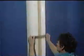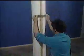Fill all holes that were recessed for rivets and screws. When filling various configurations of the base or capital, a paint stick or simply your finger will do the job. Allow to dry 5 minutes or so. Using a flexible rasp blade, remove the excess body filler following the contour of the column.